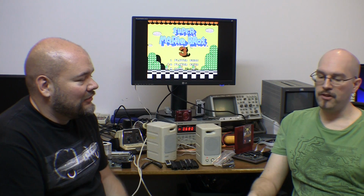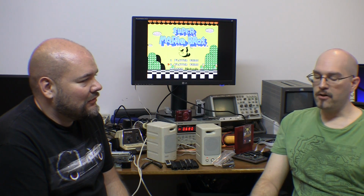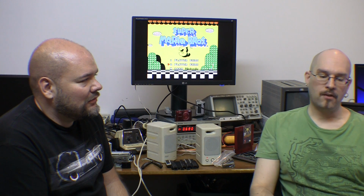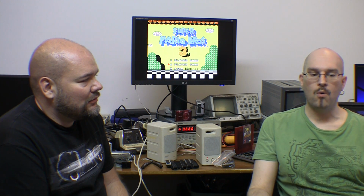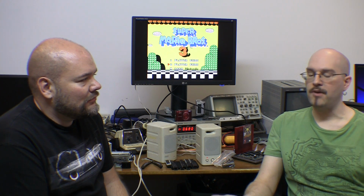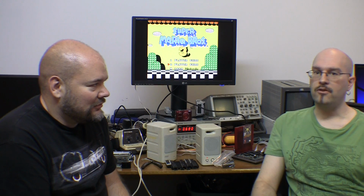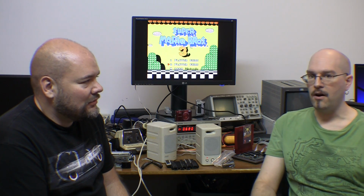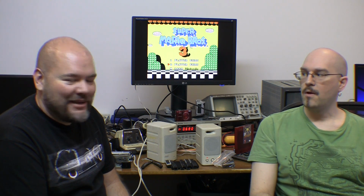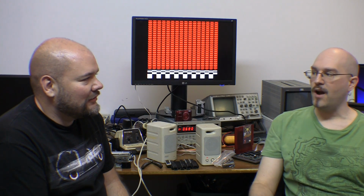Yeah, the Power Pak just needs the mapper. It doesn't need the audio hardware. The one minor downside is I cannot accept external audio, so Power Pak audio won't work, but who cares, since I'm generating all of the expansion chip sound anyway. And it's digital, it's not analog at all. So amazing, this is going to be awesome. It's 100% noise-free audio, theoretically.